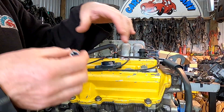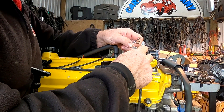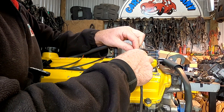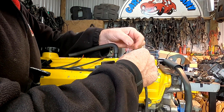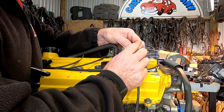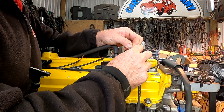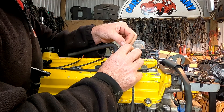I've already terminated this up. I used a piece of three-core shielded tefzel wire. At the other end I've taken the shield and added an earth to it — you only earth the shield at one end. I'm going to make the orange trace wire number one and the blue trace wire number two.